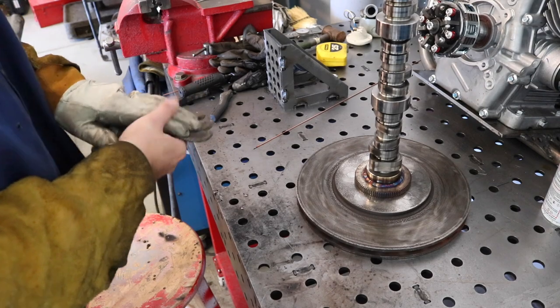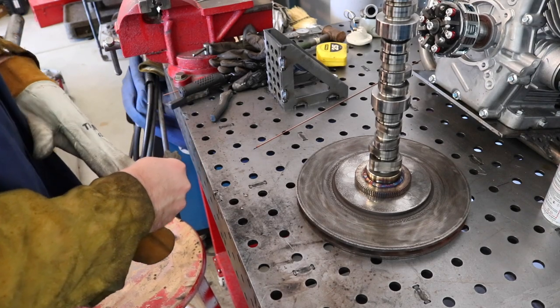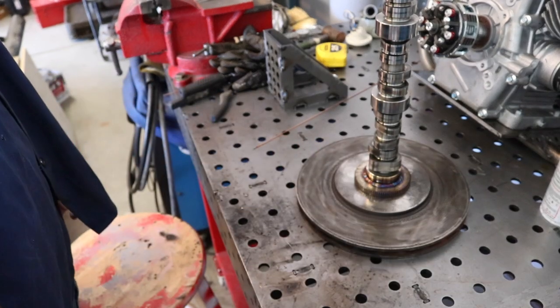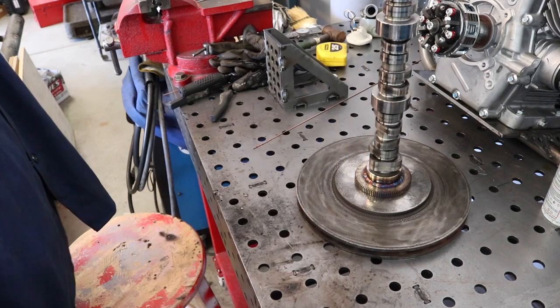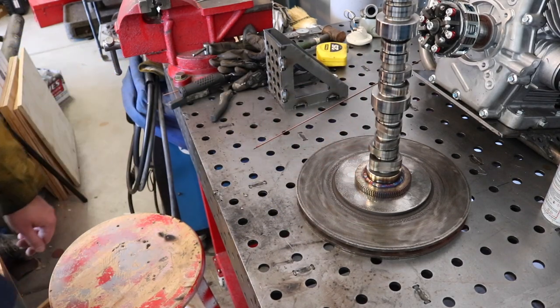Yeah, normally if I was welding this for structural, I would do the post flow and all that. Just because this is a lamp, I'm not really worried about it, so that's why you see all the discoloration for the most part. I'm just stopping the post flow too soon, so all the oxygen is getting sucked in and doing all that.